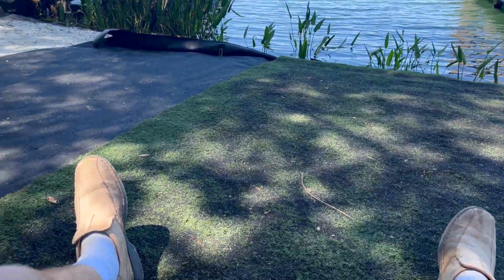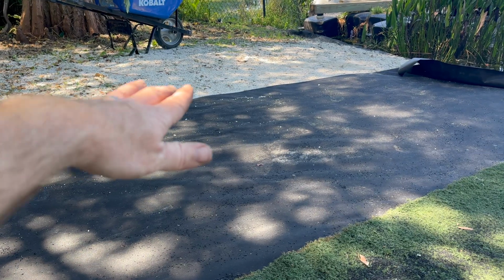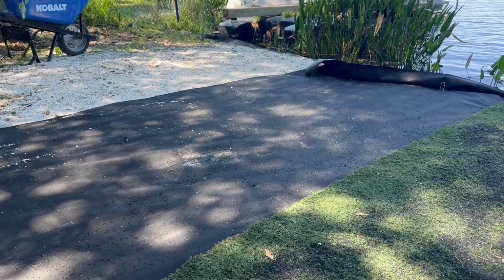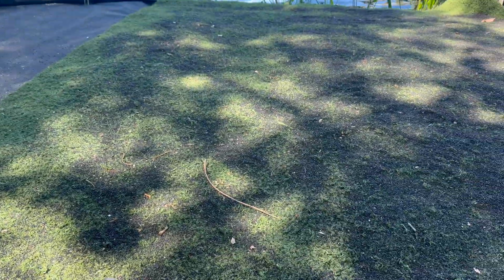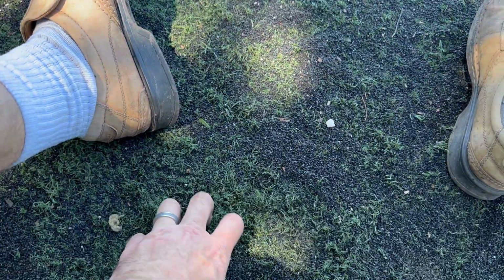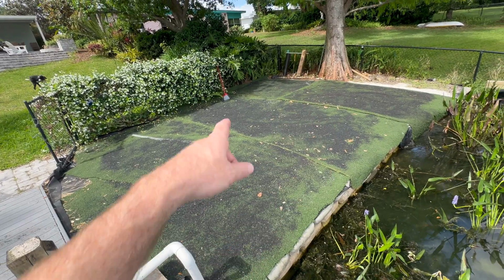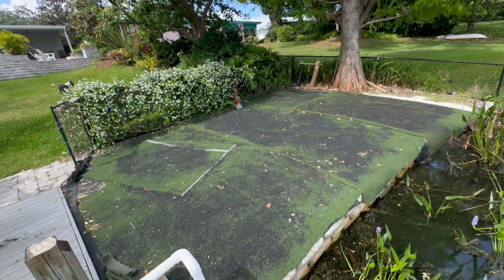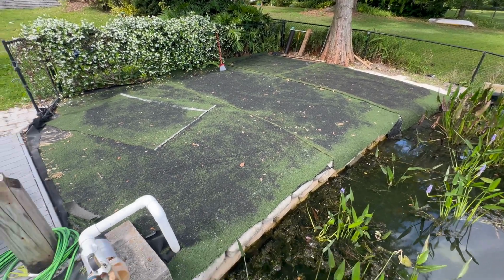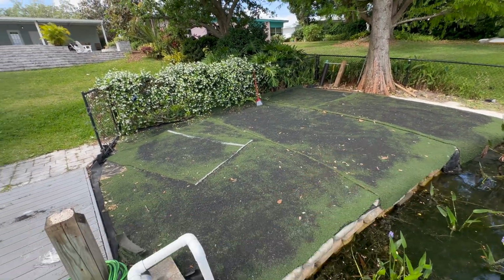So a quick update, sitting here in the chair, dreaming about using this beach. We flattened and smoothed it out, and put down some limestone screenings, weed mat to keep the weeds out, and this is recycled baseball field turf. All the black stuff that you see on top of it is the infill. Pulled it, cut it, got it roughly shaped to the area. Then we got to go back and actually cut the lines where they overlap because not everything is perfectly straight. When it was cut off the field, we'll trim off this base edge. We're going to run a cap board down along here, kind of tidy all that up.